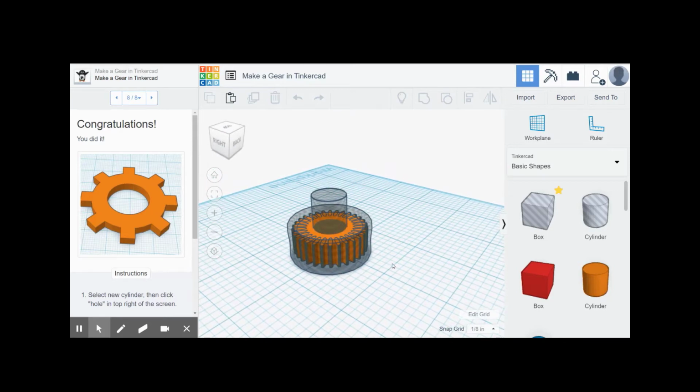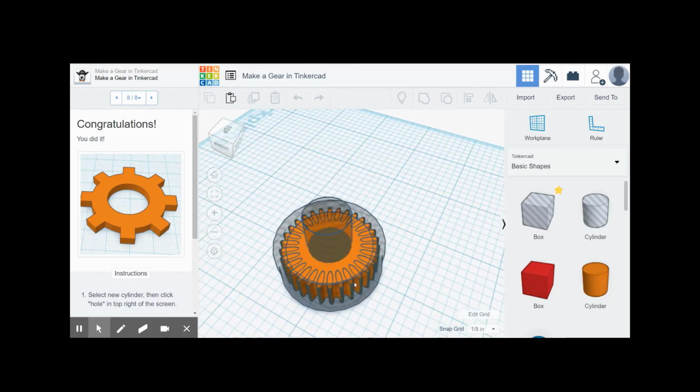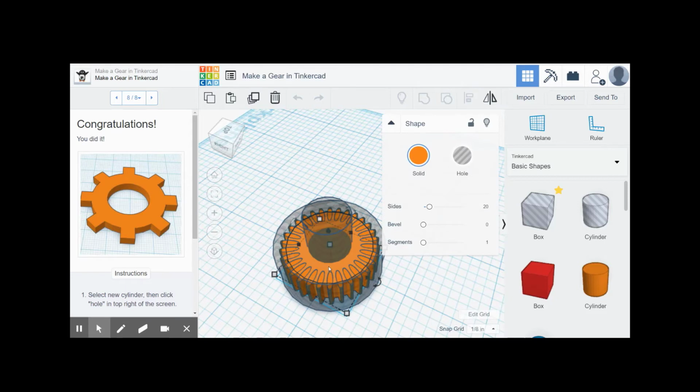So essentially I mapped out this little piece of rice looking thing for the gear, shaved off the edge, and kind of rounded it with a donut shape. So sort of 3 shapes here. This one here, the solid shape, was the minor diameter, so that was the 1.672. And I cut a hole in the middle with this hole cylinder to the 0.772 dimension.